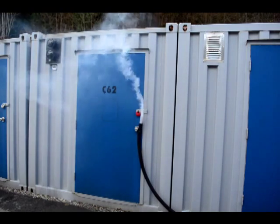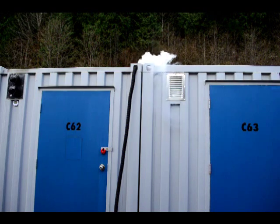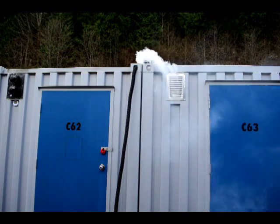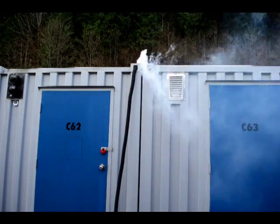There are many advantages to mounting vents on the door end of the container versus the rooftop. Mounted vertically, the vent is protected from debris or snow, easy to seal, and most condensation forms around the door area. Wind also accelerates along the ends or sides, especially if there are a few containers in a row mimicking a valley or wind tunnel effect.